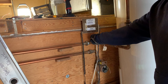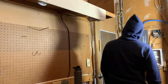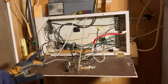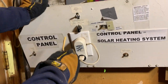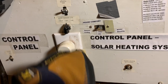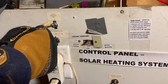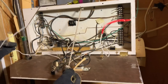He hooked up some solenoids through the water tank and labeled it as he went along. The doorbell switch was a test button, and this was summer versus winter. The system had quite a bit of stuff on the backside — power came in here, went to a timer, came out of the timer to control the winter versus summer cooling. There was an exhaust fan up there and dormer lights up in the control panel.